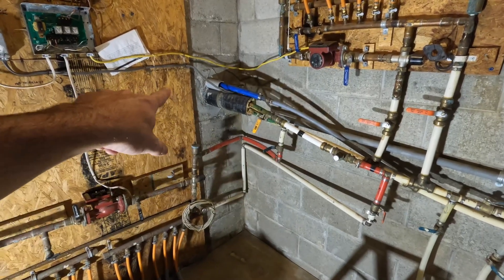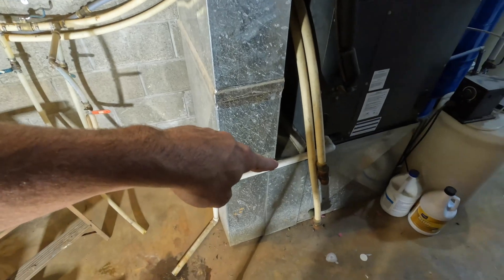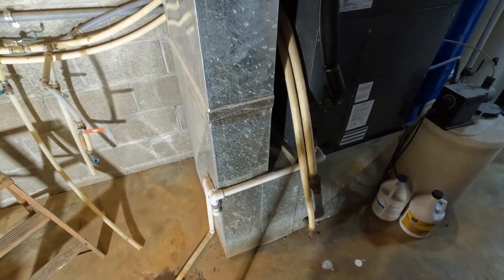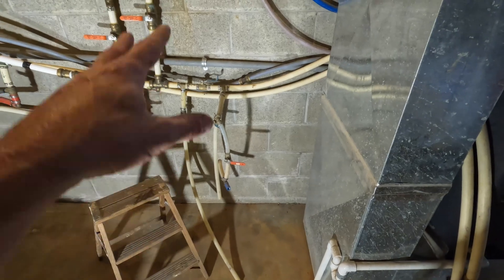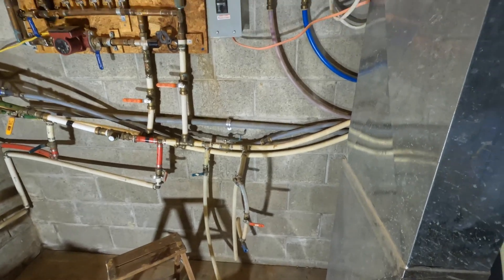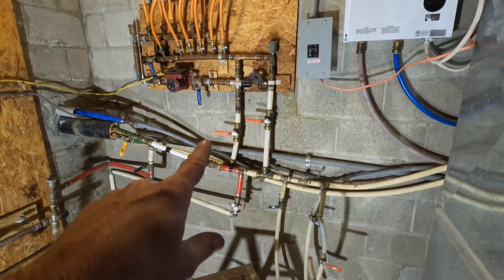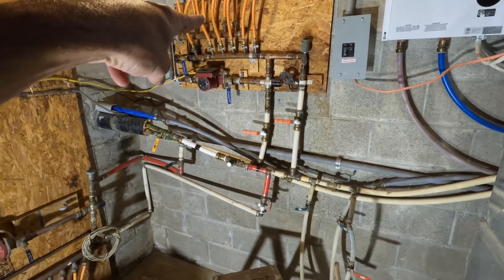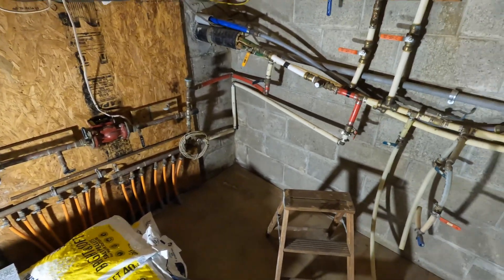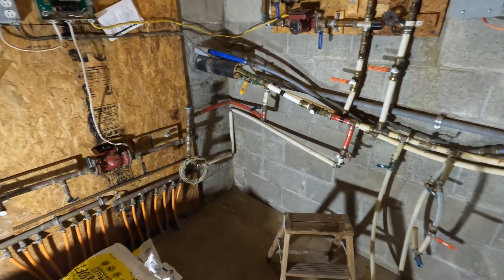That's my inlet and outlet going in the black pipe. Above that in the blue pipe, that's my well pipe. So the boiler goes in, goes into the forced air heating into a heat exchanger, and a fan blows on that and forces hot air through my whole home. I did have a stand-alone hot water tank with a heat exchanger, but I got rid of that — we went right to on-demand heat because we used too much hot water. Also plumbed in is my in-floor heat in my garage and in-floor heat in my basement. They don't really work as well as I think they should, so I'm going to be working on making this more efficient.